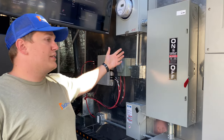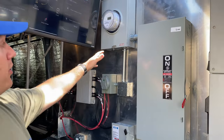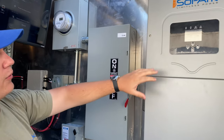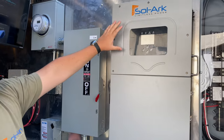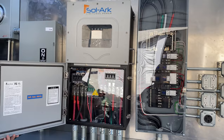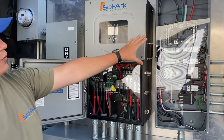Because it's a van, I have it hooked up for a generator, but this is a mock-up of how it would be in your home — with a meter, a 200-amp disconnect. This is all live right here. I have a 15k, and from here I've got the grid power coming in and the load coming out to power my whole main service panel, just like you have it in your home.